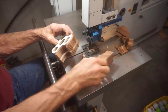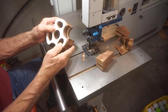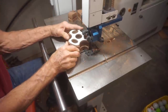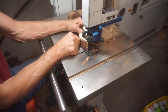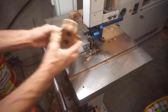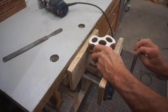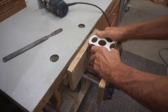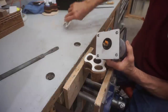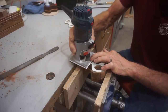At this stage, with those large chunks trimmed off, the caddy looks a bit like a ninja throwing star. So to make the caddy a little more user friendly, I cut a little proud of the three-quarter inch diameter outline of the template on the radius corners too — if you choose to go with a ninja throwing star design, just skip this step. After cutting the shape on the bandsaw, I go back to using the router and flush trim bit to transfer the template's contour onto the outside of the block, checking that the bearing is riding on the template.